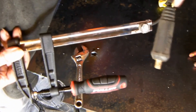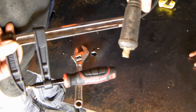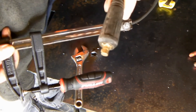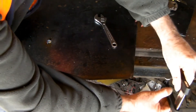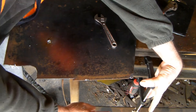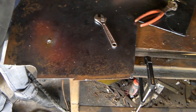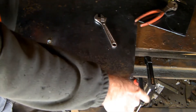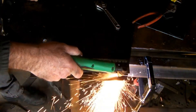So we've got it on the end of our plug here. If you want to make an extension or use the same ground clamp for welding and plasma cutting, check the links down below. Let's go and kick this in the guts and see if it actually works. I'll attach it to this bit of the table — you can see how that's quite thick, so it gives you a lot more options of where you want to put your earth clamp. Put it upside down like that with your wire hanging down the bottom so it doesn't get in your way. Just a couple of little turns — tighten it up like so. Oh, that's a lot better! Got some power back in here.